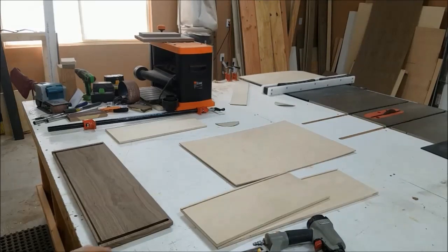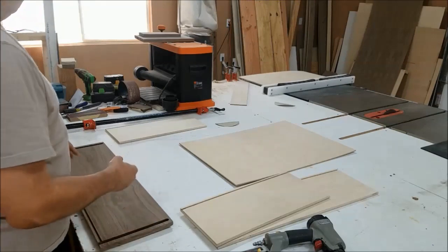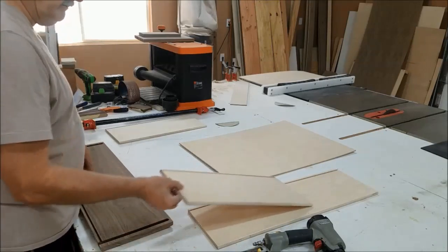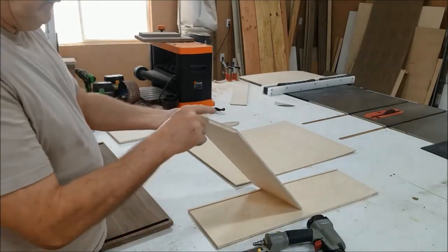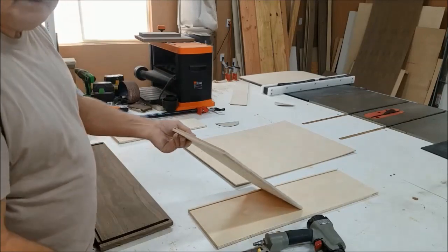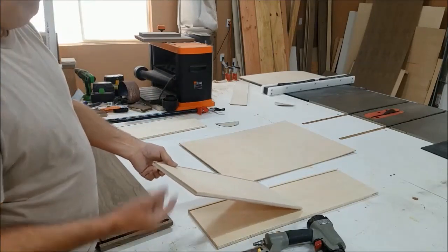Okay, this high chest I'm making, of course, is made out of solid walnut. Face frame, top, sides, everything, with the exception of the drawers, which are made out of Baltic birch. I like 1/2-inch Baltic birch for 2 reasons. It's 9-ply and it's unidirectional, which means that all of the plies are going in one direction. It makes for an extremely stiff piece of wood in one direction.